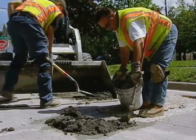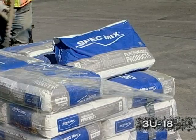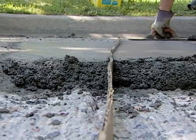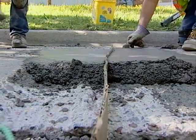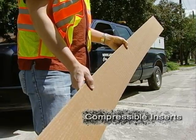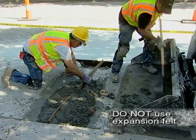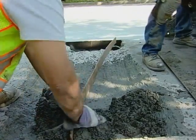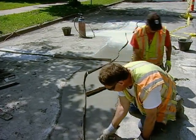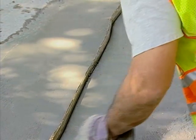You're now ready for the concrete patch. This is not the typical concrete used to pave roadways — a special concrete called 3U18 needs to be mixed on site. Before placing the concrete patch material in the milled area, use compressible inserts to reestablish the crack. Compressible inserts are essentially cardboard covered in wax. Do not use expansion felt for partial depth repairs — only use them for full depth repairs where needed. The insert will help turn the crack into a new seam between two smaller concrete panels, and the managed crack will prevent an unmanaged crack from forming.